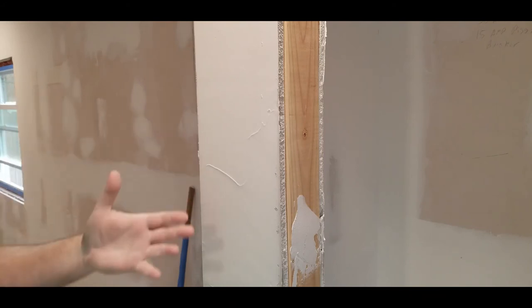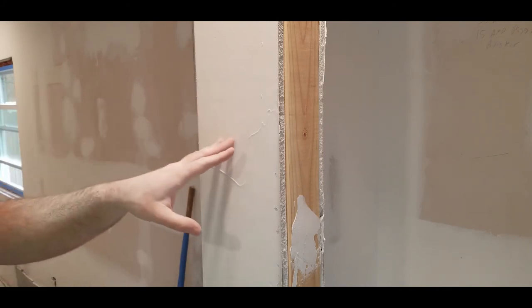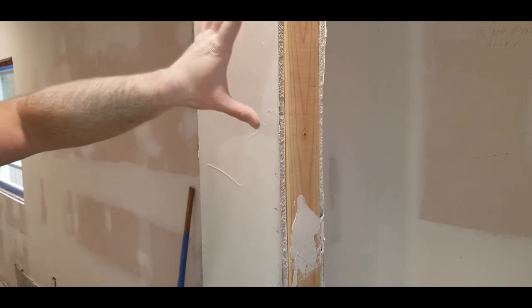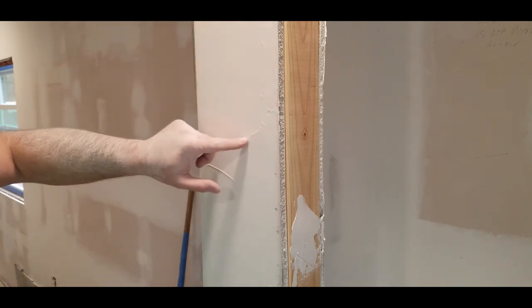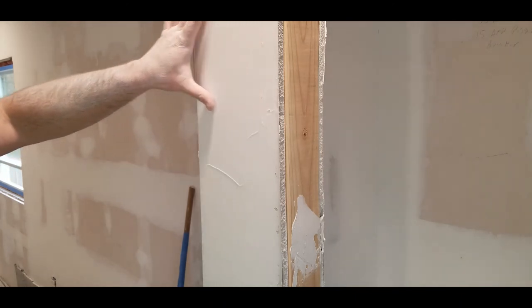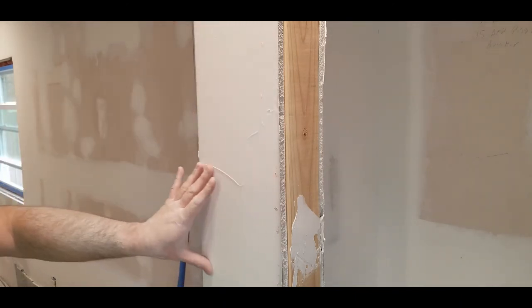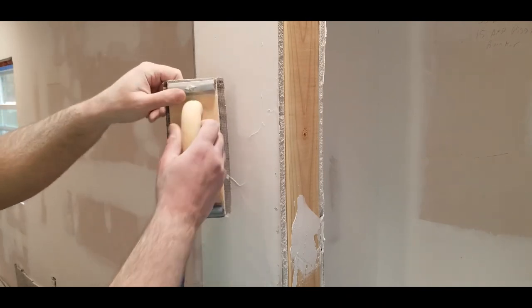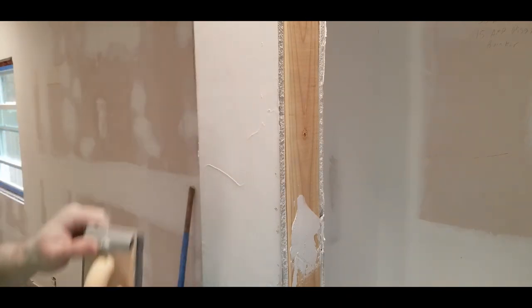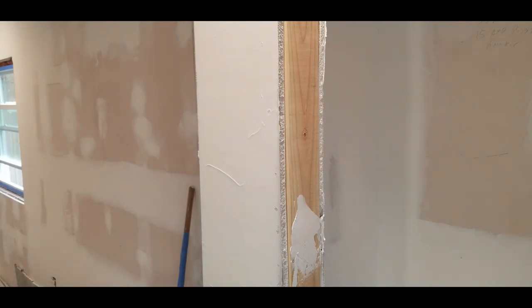If something's already there that's bulging out and it's been painted over, you can't sand it, you can't fix it, you can take a wide spackle knife and you can feather it from being a quarter inch thick here to tapering down to nothing above it and below it. But if you put a straight edge on that, it's gonna be like a seesaw, which is a sure sign of poor spackling. But sometimes you can only do what you can do.